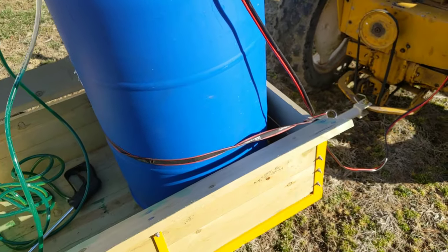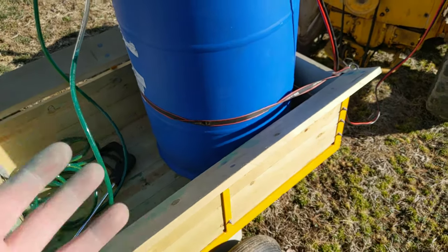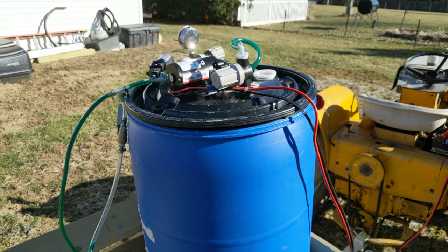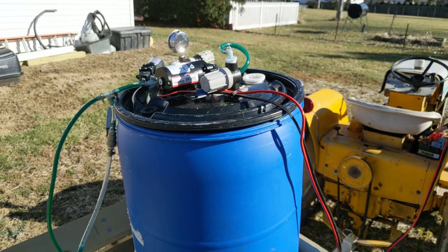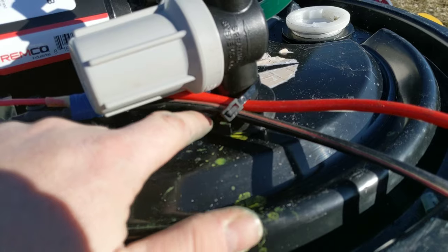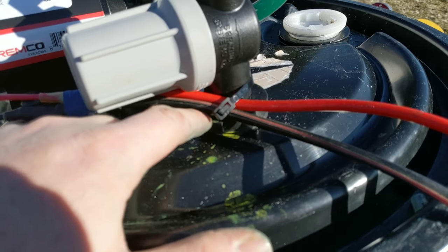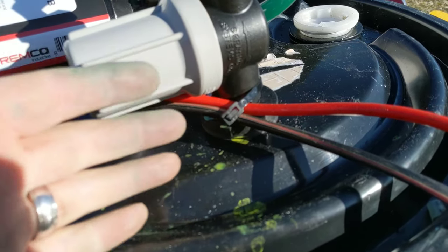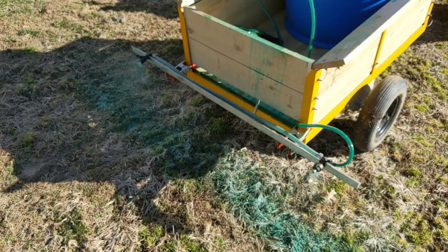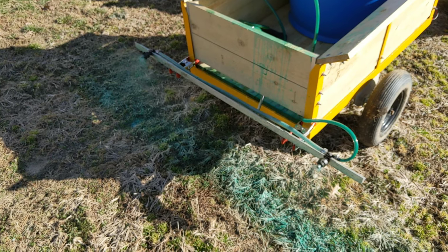That makes this entire contraption fairly portable. When I'm all done there's nothing bolted onto anything — I can just take the barrel off the trailer and do whatever, pop the lid off and put it in storage until next season. To get the tubing inside the barrel, I bought some bung connectors — I found them at a tractor shop. You just drill about a one-and-a-half inch hole and it's a coupler on the top of the lid. On the inside it's just PVC, and I left my return line on the left side kind of high so that helps mix it, and then the pickup tube goes all the way to the bottom.